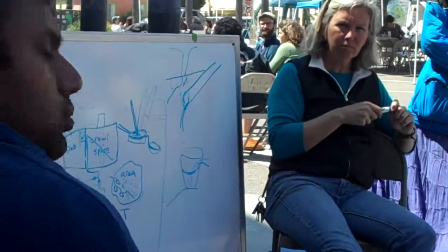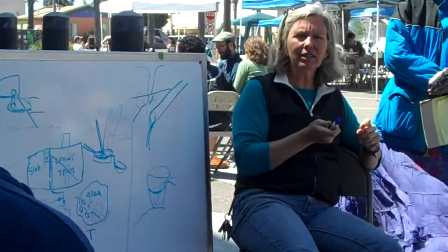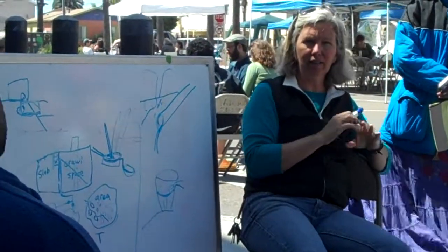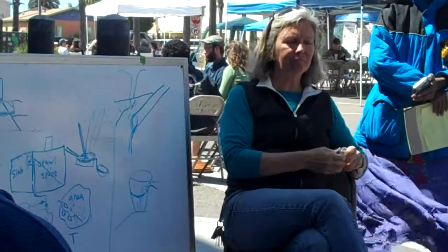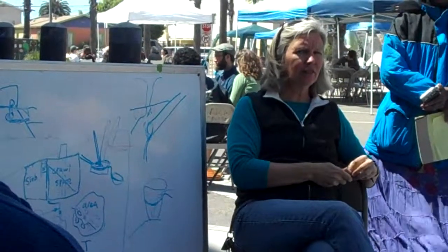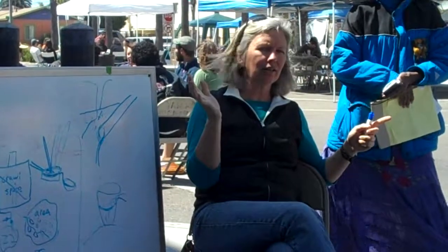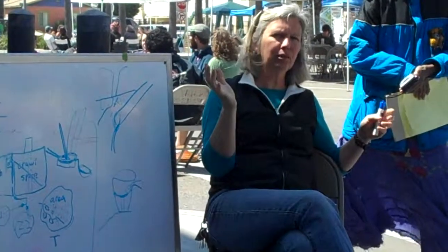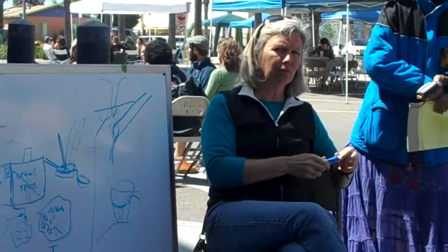Do you have experience with using kitchen sink water? Kitchen sink would be against the law. Right, they don't even consider that greywater. You could do the kitchen sink, but like he said, we have to be really, really careful, because you would have food particles and they would go septic pretty quickly. So I would have heavy filtration if you wanted to do it.